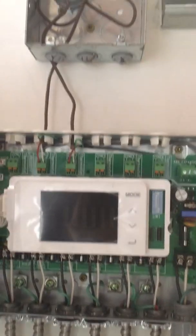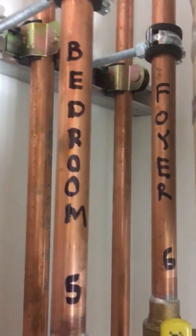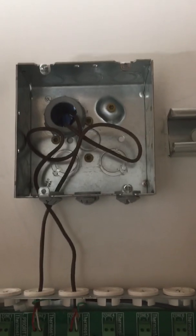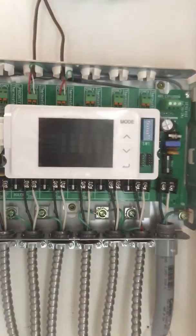We're not going to have all of our thermostat runs right now — we'll have to come back at the very end and run the foyer and bedroom, or we may have to wire those in later. What we did is put a junction box here and we're running thermostat wires up in that bay. They'll all come down and pass through this junction box, then they'll splice down inside to our relay.